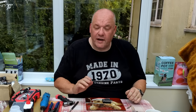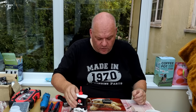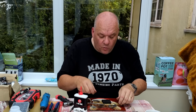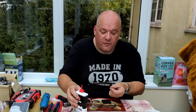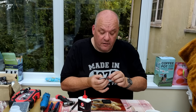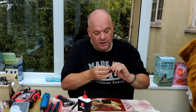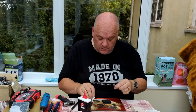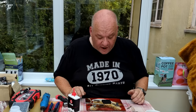So we've taken our trigger apart and given it a good polish. How much lubrication do you put in - do you whack a load of grease in there? No - a tiny, tiny amount of three-in-one oil, but essentially it's just rust protection. Take your trigger sears and put a bit of oil - literally a quarter the size of a pea - and just give each surface including the areas you've polished a little wipe with your oily fingers. Less is certainly more - you don't want it too lubricated.